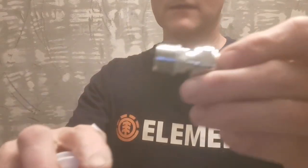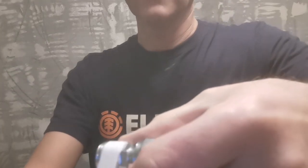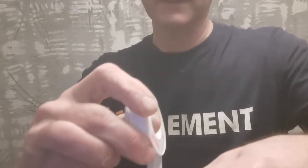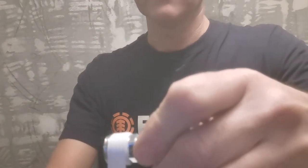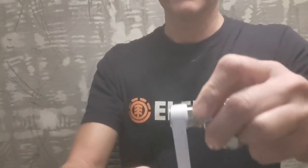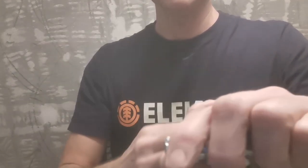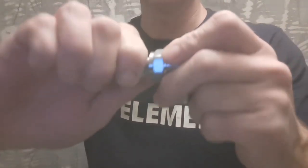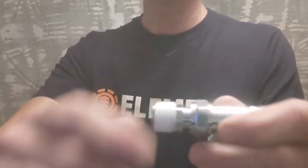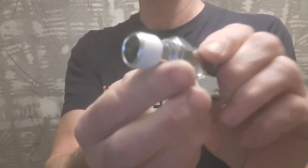This is the easiest way I've found to apply PTFE tape. If you're right-handed, hold the PTFE tape in your right hand and the lock shield in your left. Start by putting your thumb on and go around clockwise, keeping it under tension. About five turns is enough - some manufacturers recommend three turns, but some PTFE tape is thinner and you may need five or six. The PTFE tape forms the seal.